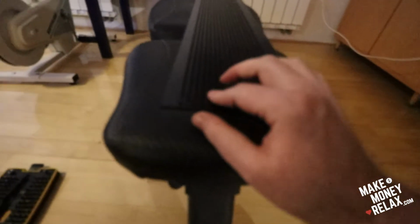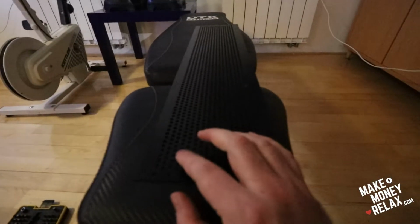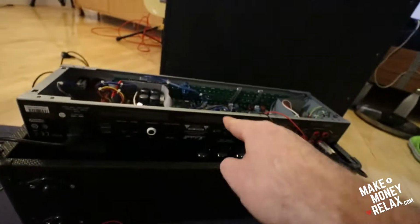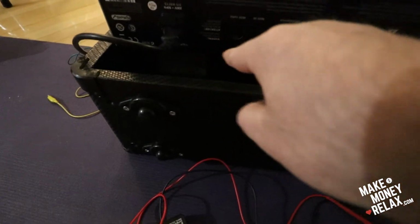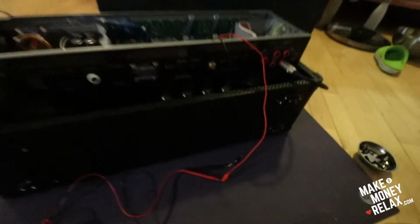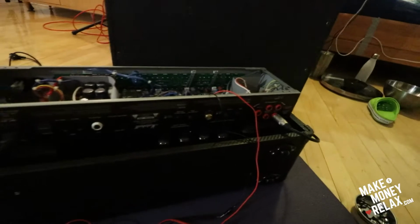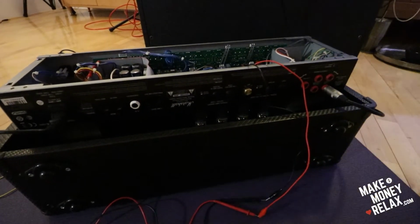First you need to take off the rear plate, and there are 4 screws there, the smaller ones. And then you take out 4 screws here near the feet. On each side they look like this, the big screws. And then you just pull out the amp. You can grab it by the transformers, like a big metal plate, and just pull it out and turn it around and put it on top of the housing. I was afraid to do it.